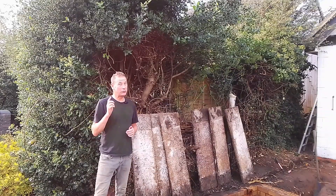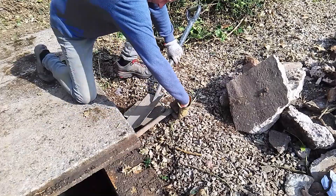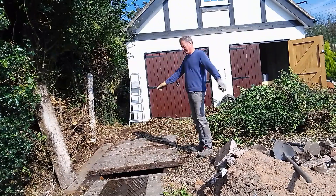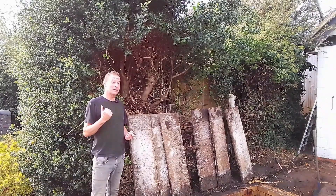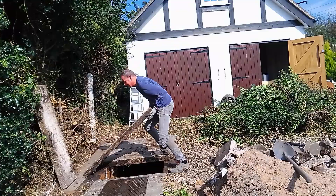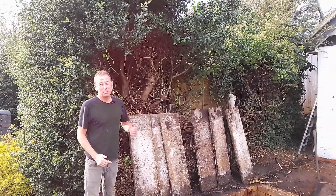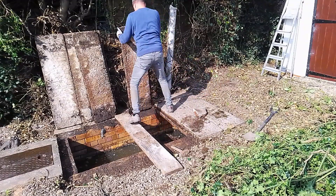A few things to bear in mind if you decide to move these slabs yourself. They are very heavy — be careful, do some warm-ups, don't strain yourself, bend and lift using your knees, all the usual stuff, and if in any doubt get some help. The guy from the septic tank company says they often jimmy them to the side and slide them away. I've lifted mine vertically and leaned them against the hedge. If you do that, make sure they have a good lean so they can't topple back on you — it could easily kill you. I've placed all mine on a plank to stop them sinking into the ground and to spread the weight.